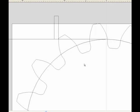Here's another spot. Now this is the position most written to me about by Gearotic Motion users. They would be cutting a gear, and what they would find in the end is that on their final passes the tool would not be touching the edge of the gear. It would in fact be off in space somewhere out here, for example, and they would be wondering why I put in a pass where the tool is not even touching the edge of the tooth. Things like this would happen because of inconsistencies in the math in the user's own setup.